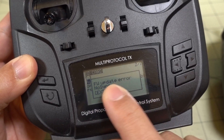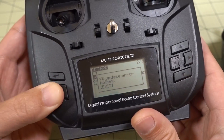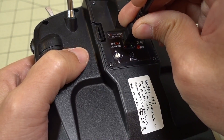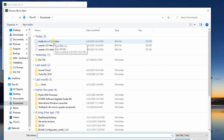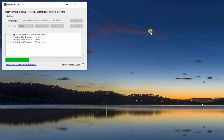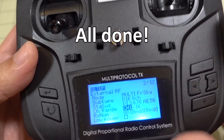It appears we're not able to do the update via the radio. I think it's because it's not the internal module — this procedure only works for the internal module, which is why we're getting the update error. What this means is we have to flash the module via the mini USB port. You're going to have to download the Flash Multi app on your Windows PC — I'll put a link in the description. Load up that same file in Flash Multi. Once you plug in the mini USB to your computer, it'll show up as a COM port. Select that COM port and then flash the module from the Flash Multi program in Windows.